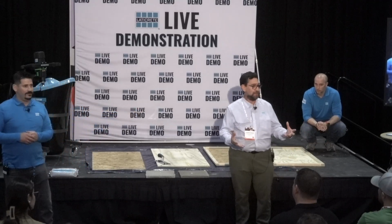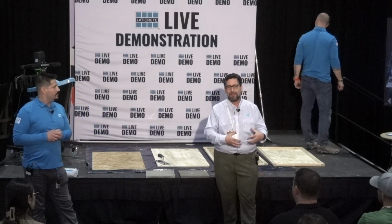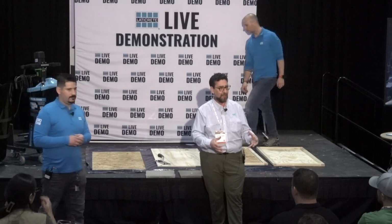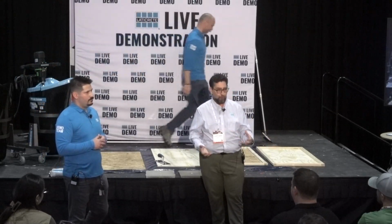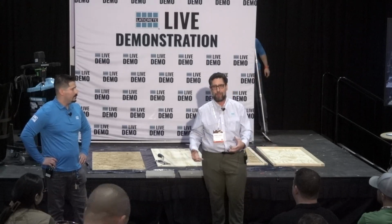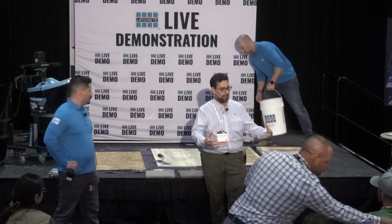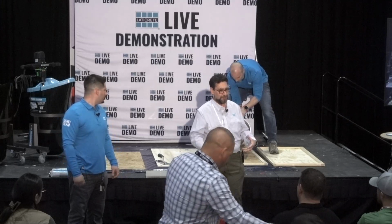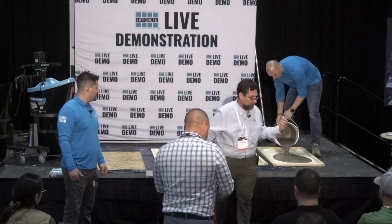We've been doing lightweights for years in self-leveling, and this product that's coming out now is the culmination of years of experience with these types of products. The challenges we wanted to meet were not only to satisfy the engineer and the architect for reduced dead load, but also the challenges facing the contractor, which is not having to carry around and work with as big and heavy a bag or set of bags. But the real challenge was to get all those properties in a product that flows like a regular self-leveler. We don't want you to see the difference between the lightweight and our standard SLUs. Hopefully, that's what you will see and confirm for yourselves today.